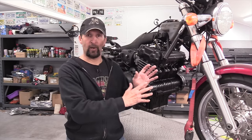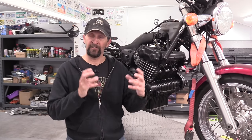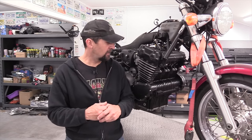I can MIG weld, though. So that's what today's about. That's what this video is. Before I go buying all those bends and I go that way, I'm going to see if I can take some scrap stainless tubing, load some stainless wire into the machine, cut it up and weld it up. And see if the welds come out sound and solid and okay. And if I grind them back, they stay that way and they're gas tight. And if that is the case, then I can make my own exhaust from scratch. But we won't know until I've tested my skills at welding up the tubing, because that's fundamentally the center of the job. So let's get stuck into that first. Load up the machine with some stainless and see how we get on.